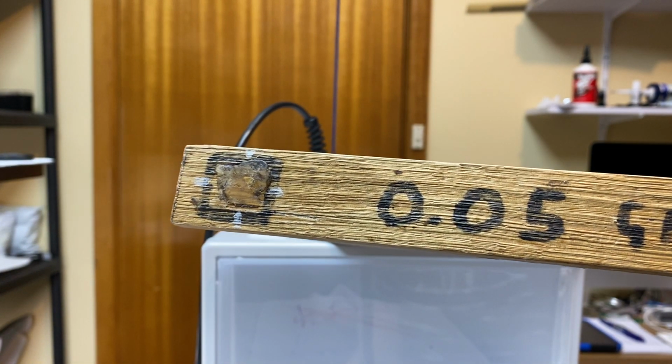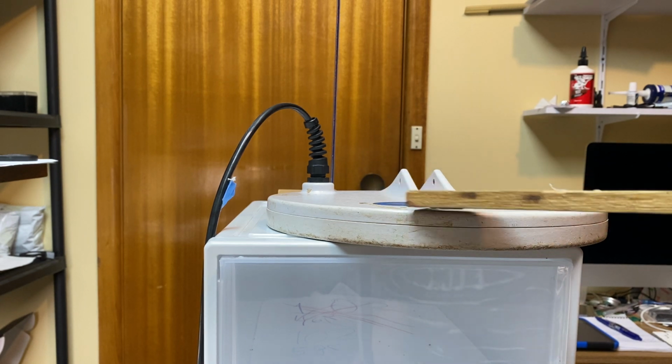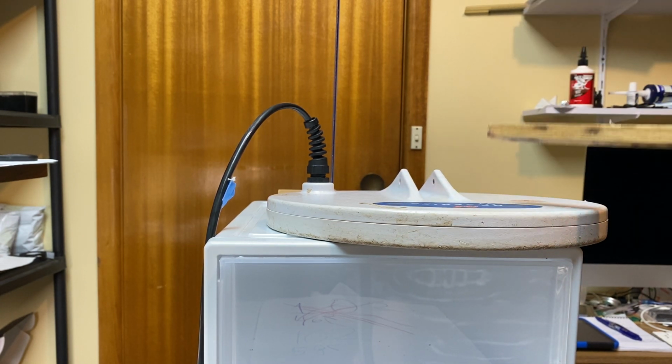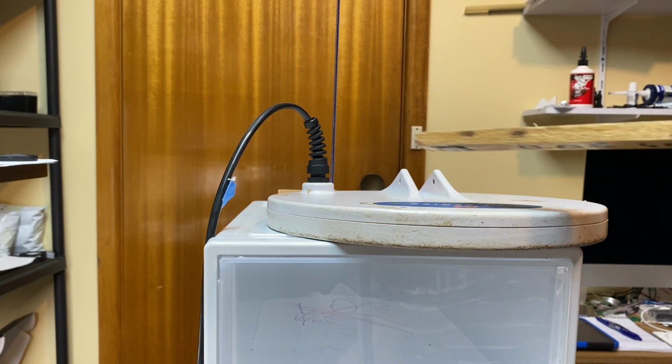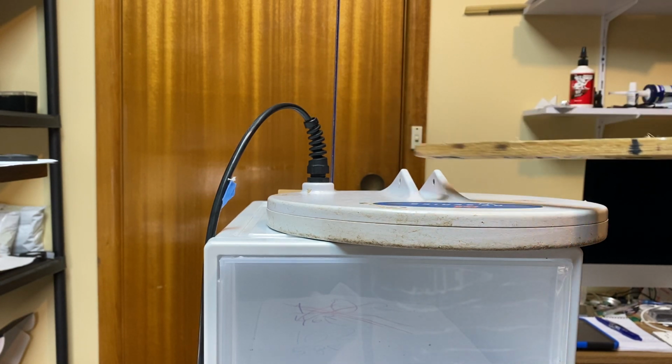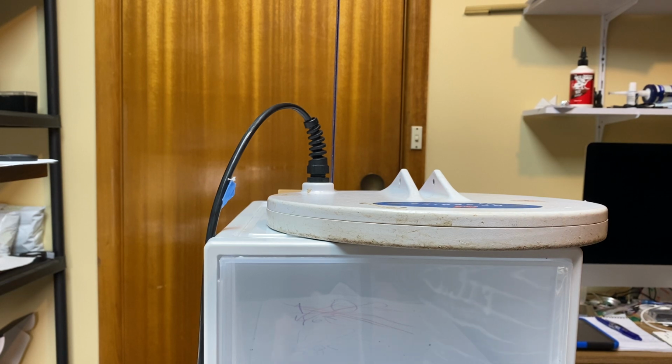You've got the 0.05. And remember before we had to scrub the coil like this to get a signal? Well, even though it's very soft, I'll show you why in a second. Hope you can hear that. I'm getting up above the coil mount, but at the moment, because there's so much electrical interference, I have the gain turned down. So I'll turn the gain up a little bit, and I'll show you that you don't need much gain to make a significant improvement. I had the gain nearly all the way down, that might be about half, but now we're going to pick up the electrical interference.